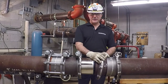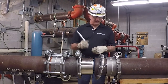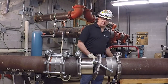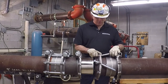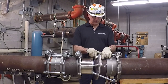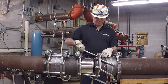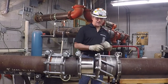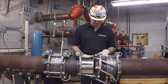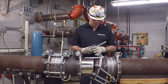The next step is to install our bolts onto the flange clamp and locking flange clamp. These bolts go in different directions and come in three different lengths. The longest bolt goes into the flange clamp facing away from the machined surface. One of the two shortest bolts goes toward the machined surface. Medium-length bolts go away from the machined surface — there are three of these. The second shortest bolt, 180 degrees off from the first, also goes toward the machined surface. The remaining two medium-length bolts go away from the machined surface.